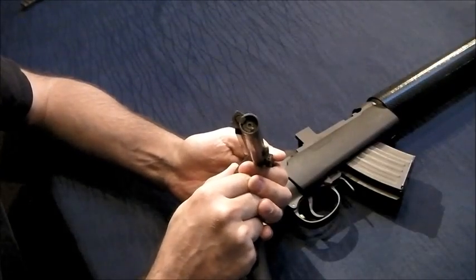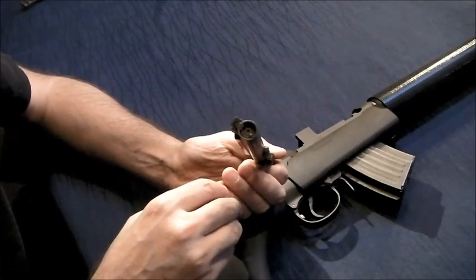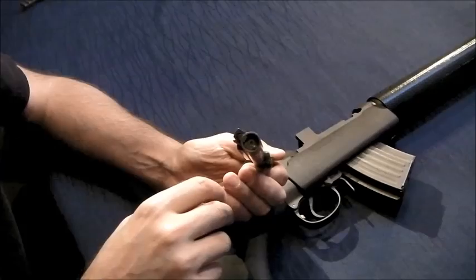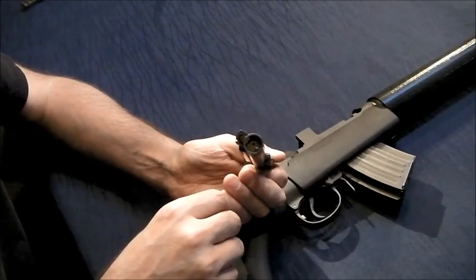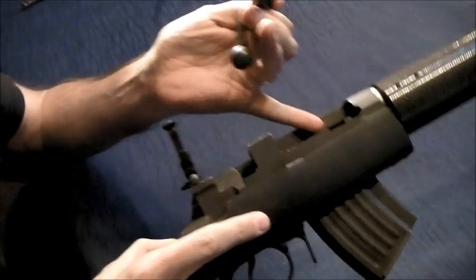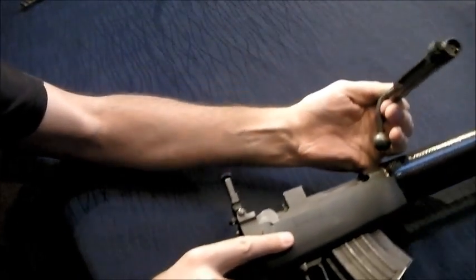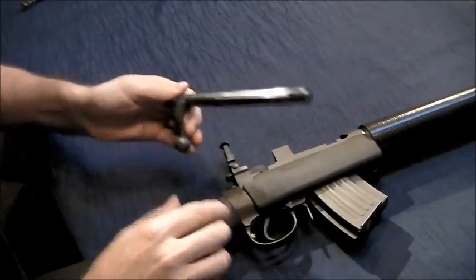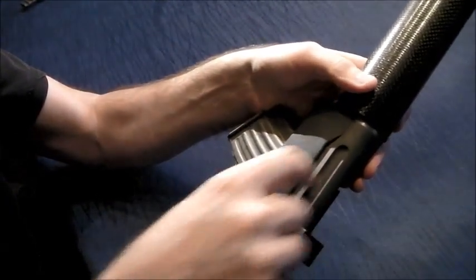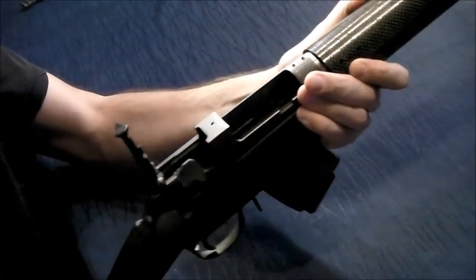Now, talking of the bolt, here's a major departure from the original Lee-Enfields. The original Lee-Enfields will have a flat bolt face with an extractor claw hooking round onto it. And how they manage their ejection is that the extractor claw pushes the rim of the case against the side wall of the receiver, and with an empty case it's actually friction with the side wall that works as the ejector. On an original, there's also an ejector screw about here, so that any cases or live rounds that don't eject under friction will flip out.